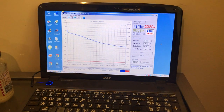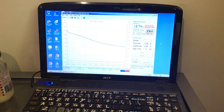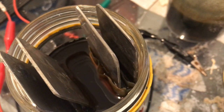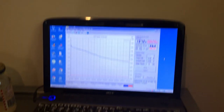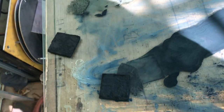This cell needs to run for about two hours on an hour's charge to be any good, and it's achieving that. I don't think the electrolyte is damaged — I think the brown stuff is iron-3 metal going around. That's why I swapped the membranes on that first plain cell, so we've got iron-3 on the negative side and zinc on the other side. Hopefully the separator works on that side.